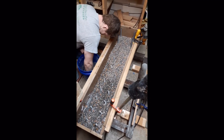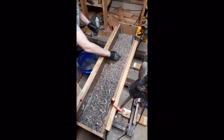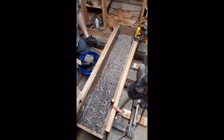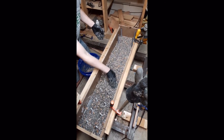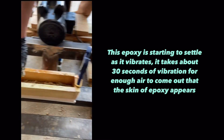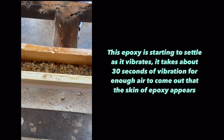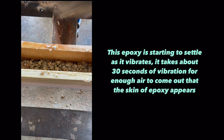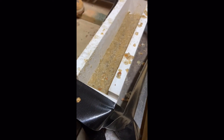This is footage of me putting the epoxy granite in my actual mold. The epoxy granite in the bucket feels like barely damp rocks and sand — you can just barely compact it into a snowball shape in your hands without it breaking apart. Once I vibrate it at the correct frequency, so much air comes out that it actually has some excess epoxy that sits on top as a skin. This sample here is starting to show that pure epoxy skin.